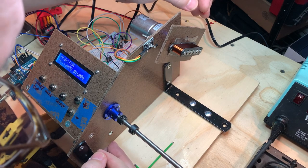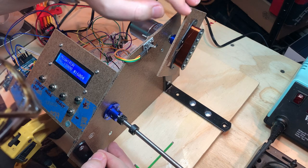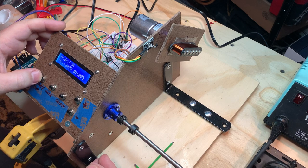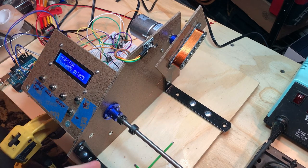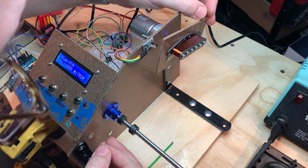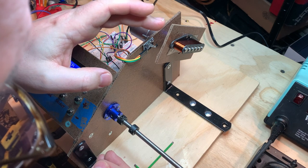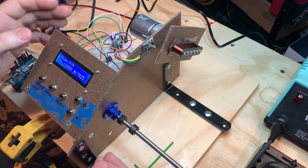But also the bobbin is getting pretty full. This perhaps, I don't know, 1/16 of an inch, looking at it from there, but the bulge in the middle, sizable. We'll see if we can fit it on. There's 7,000. Pretty full. But allowing for the fact that it's not going to have a cover on it, it may still fit into the pickguard. Let's perhaps do another 500 and see where we get.